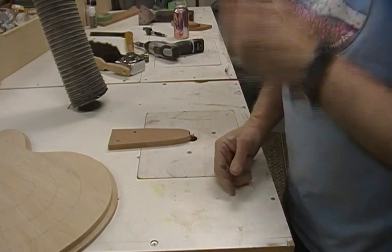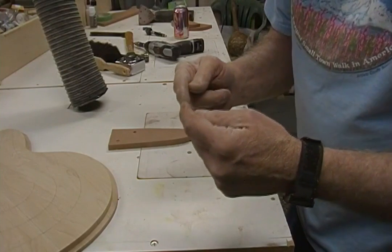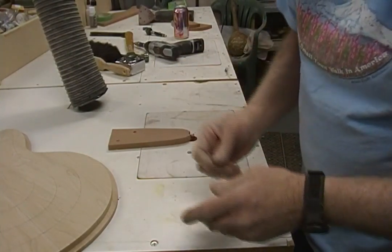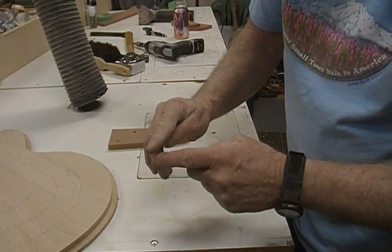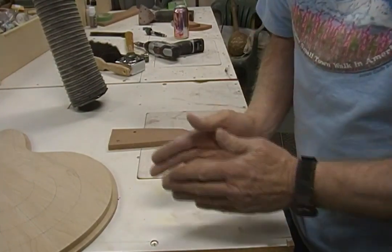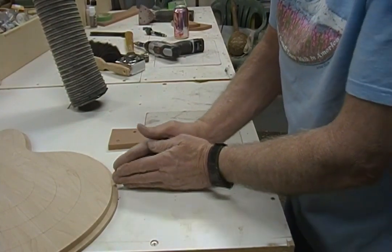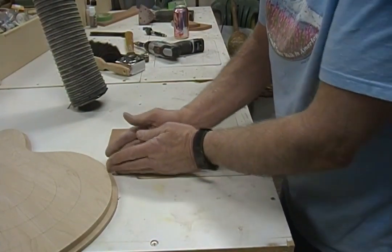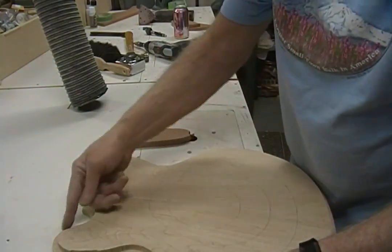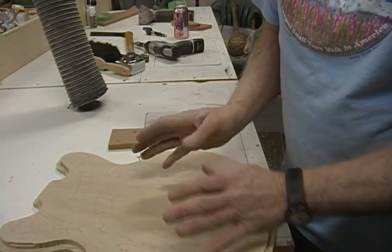So you're familiar with cutting binding with one of those little roller bits. The bearing is not in the bit, but above the bit or below the bit, and you can set the depth of your binding that way. As long as you have that bearing square to the surface or the edge of the guitar, you get a fairly consistent channel. It is tougher in areas like in here, because you've got to stay square to that. Anyway, I took that concept.